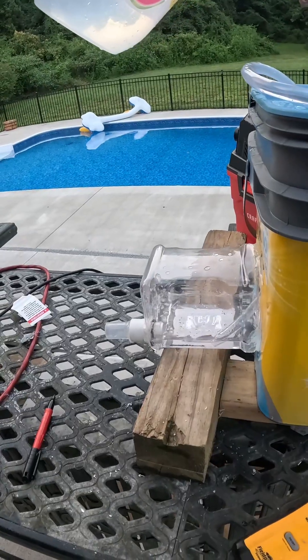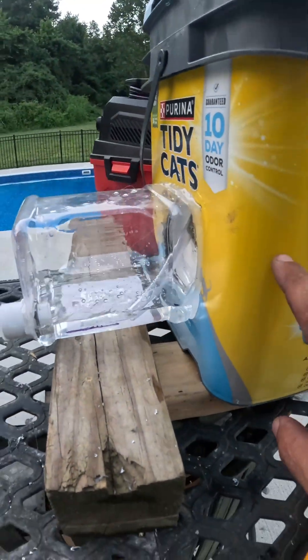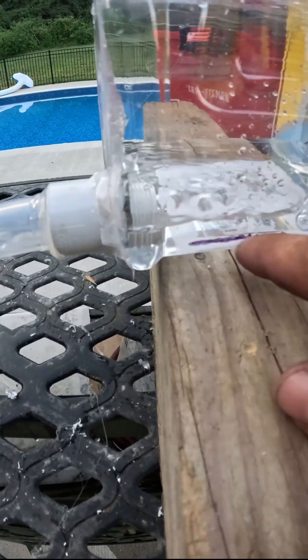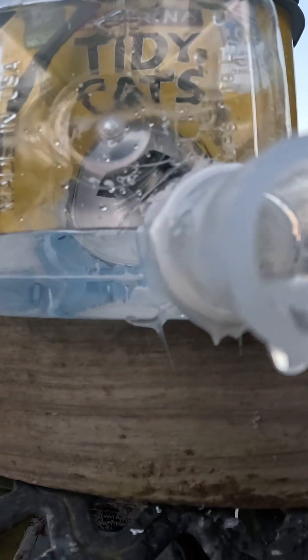Keep adding until we see a little bit come out. Now we've got some drops — look how high above that line the water level is because of that negative pressure. If your coil just had the little pan, this water would be splashing like crazy going over the edge down into the return. You can see how violent it is — you see the water level line right there and there's the opening of the pipe.